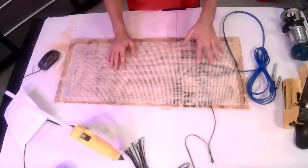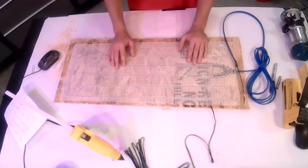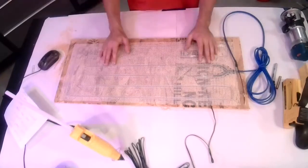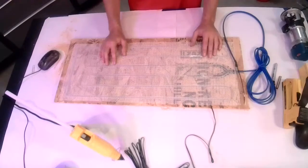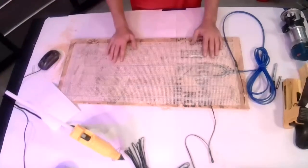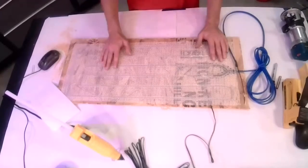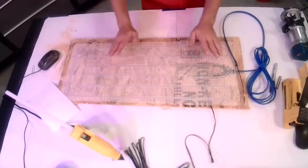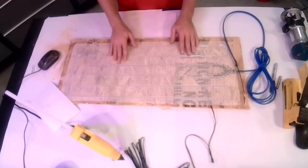and it's probably best just to reach out to us directly, and we can talk you through that. Usually what it means if you're doing it over concrete is that you want to put a thermal break material there. That's primarily to direct the heat up into the space, so you're not just warming the slab. But it also decouples from the concrete, so you have to adhere that mat down, and there's a whole bunch of different stuff. So better to talk to us directly if that's something you're going to do, but that's not something you're probably going to run into in a tiny home setup.